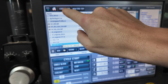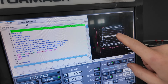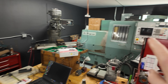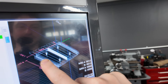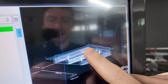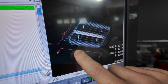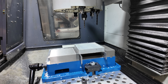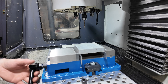I'll load the G-code — the one we just exported from Fusion onto the SD card. This is what's amazing about modern machines: they can actually show you the tool path. I'm used to machines where you're just kind of guessing, but this is great — you can actually see the tool path, which is honestly super helpful. We've set the tool height; let's give it a dry run with the coolant off.